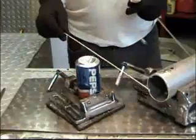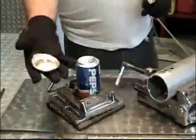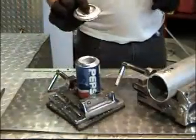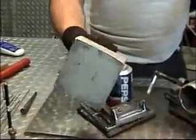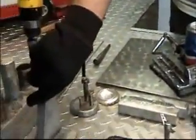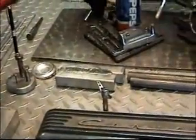You can use this rod to weld or repair aluminum. You can weld aluminum as thin as this, or you can repair or weld really heavy material. It takes the same 730 degrees for every job, and no flux is required.